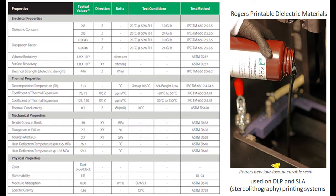The data sheet shows that the dielectric constant is 2.8 when tested at 10 gigahertz with the IPC method mentioned here, which is basically a clamp stripline resonator testing the raw material. The dissipation factor is in the range of being very good at 0.0043 at 10 gigahertz. The volume resistivity and surface resistivity values are excellent, in the range of where most printed circuit board materials are.